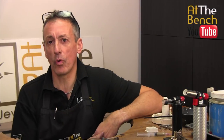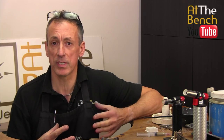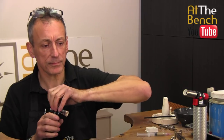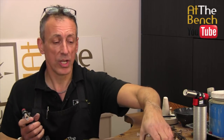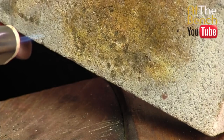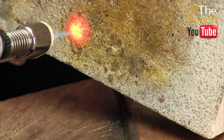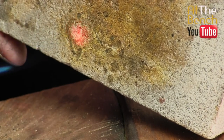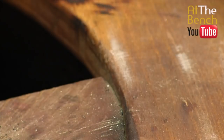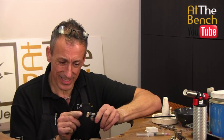In the past, I've always gone on about torches, finding the hottest point, the sweet spot, and you've seen me get the torch. You've seen me light the torch. You've seen me get a bit of a block in front of me, hold the flame up, and I do this sort of trick, and I bring the flame quite close. It gets really bright. You take the flame away, and that orange area diminishes. The hottest part of the flame, yes, is the tip of that cone.